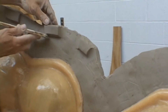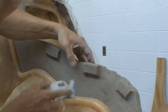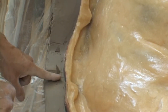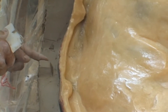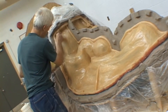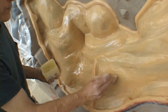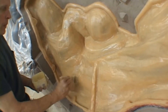Take your time here in setting up your keys. Everything must be drafted so the plaster can separate from every section. Mold release must be applied to the urethane rubber. Even though the plaster will not stick to it, this just eases in the initial demolding of the plaster shell from the model. In this case, the mold release uses Vaseline. It will guarantee that the plaster will not stick to the rubber or the clay walls.